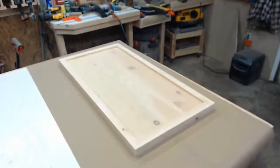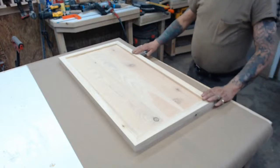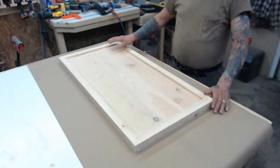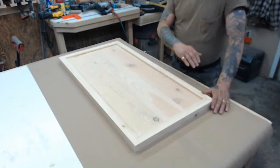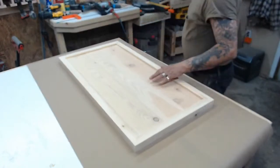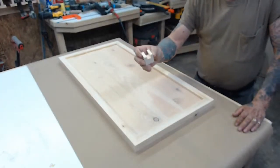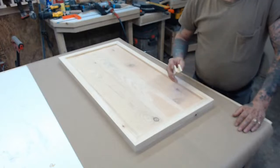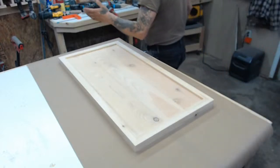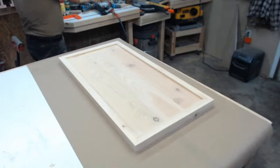The door, make sure that we can see this. The door was made out of 2x4s. These are fence pickets. They're 3 fence slats and 2x4s. I ran them through the planer and I planed off 1/16 of an inch. I put biscuits between the two, glued them together, and then dadoed or grooved on the table saw all the 2x4s that I had cut to 1 1/4 by 1 1/4 and then ran through the planer and grooved that to hold the fence pickets. There ain't nothing wrong with that. I mean, it ain't fine woodworking. This is shop furniture. It'll be fine.